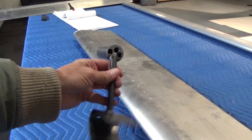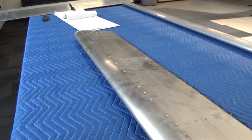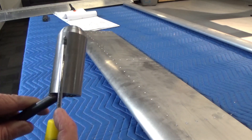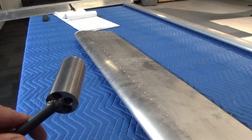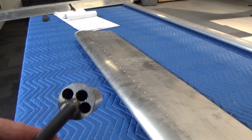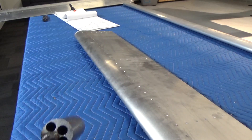Alright guys, so I'm just trying to get the weight out of these things. I've drilled three 10mm holes which go pretty much all the way to the end, into the radius, and that's got me pretty close. I haven't weighed them, but just keep drilling — I think I need more out. Then the process is I'll hook it on there and show you.